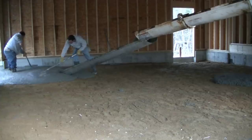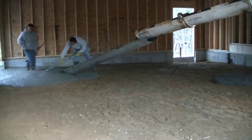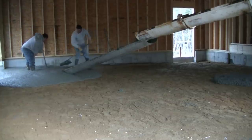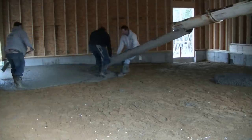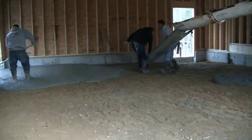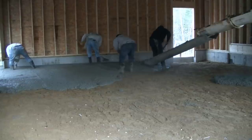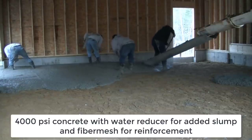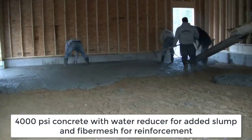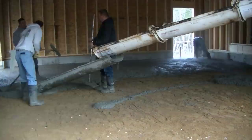You can see we're pouring out the concrete. I was hired on this job just to pour and finish the concrete and saw the expansion joints after in the floor. I was hired by the guy that did the concrete foundation. You can see we're pouring this inside a frost wall. The concrete we're using is 4000 PSI with fiber mesh reinforcement in it. It's also got a water reducer in it, which allows us to pour a little bit looser slump without hurting the strength of the concrete.